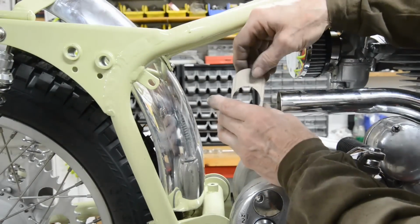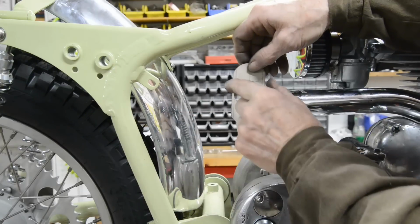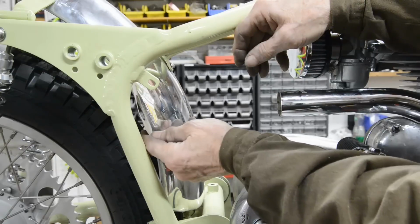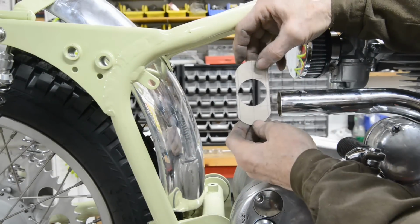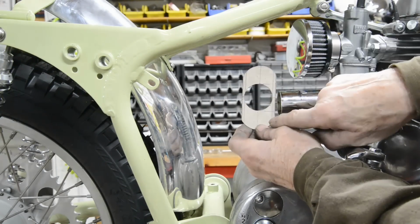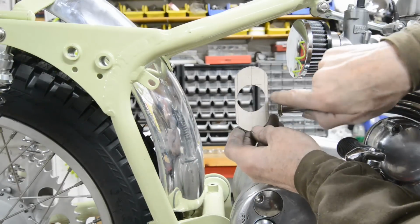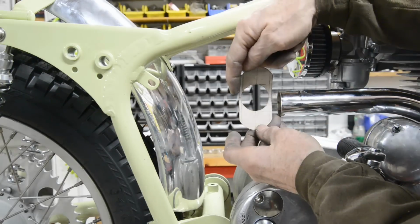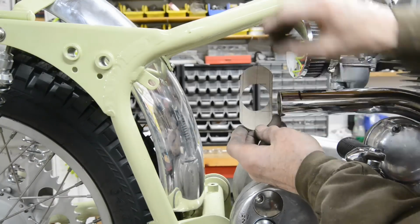Okay, there's our template. In there we had just about 2 inches. So I've made this, or I'm going to make the silencer 1 7/8 inches wide, just so as I have a little bit of wriggle room. But don't forget, if we didn't have to fit it in anywhere, we could be, you know, not that accurate with the template. But here, because it's going in there, if I'd have made this template 1 7/8 wide, when I put the skin on it, the 16th, it would have been a 16th on each side, so it actually would have been 2 inches. So the template is less that 1/8 of an inch.